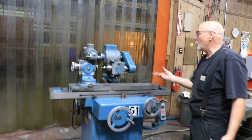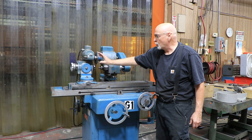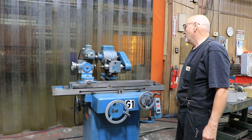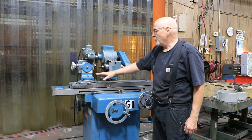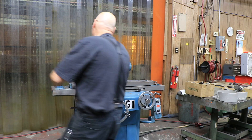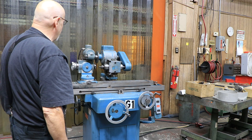In this situation they have a grinding wheel that you would mount on this arbor here, and you have a motorized workhead that's accepting a 5C collet. So you could do some work right out of a 5C collet with this arrangement. We can swivel here with the workhead, and you have a lot of different movement you could do with that.